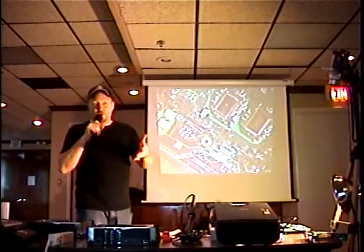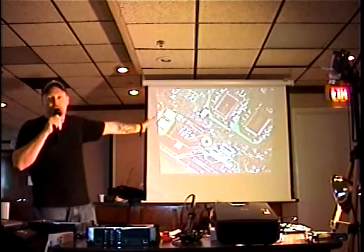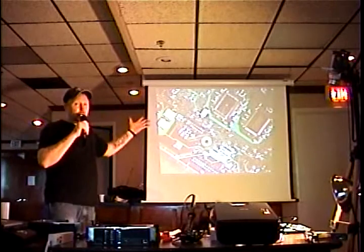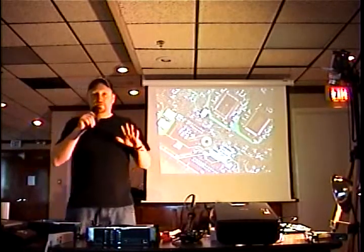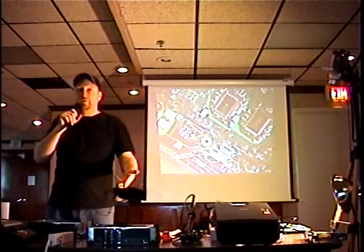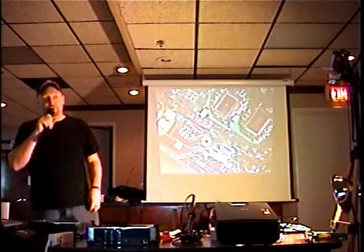There's not any video driver. Nothing's going to display on the TV. It's not going to say, you know, welcome to Linux, show you cute little penguins or anything like that. It's just going to be black. All right? That's not a bad thing. You will need to telnet into the box at this point in order to flash your BIOS,